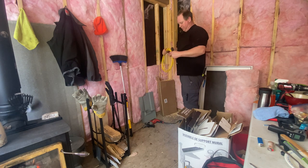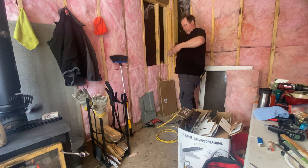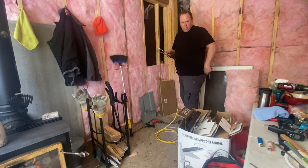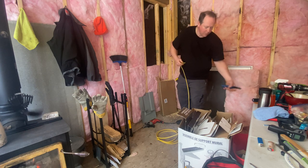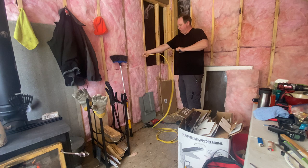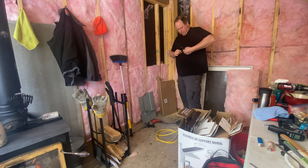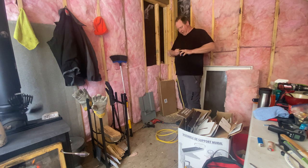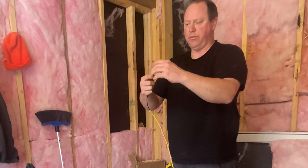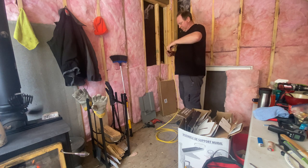Sometimes this part is the tricky part. What you'll need is a chunk of wire, a screwdriver — I've got two sizes — and a pair of side cutters. What I do is strip open the wire about the length it's going to take to get around the corner. Take one wire, fold the end over, and turn it into a round nub. That way you have a round tip that you're pushing instead of a flat one that can catch.